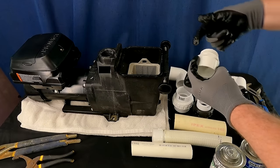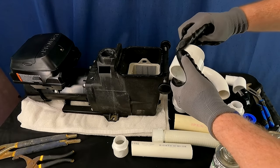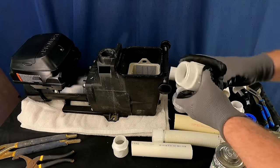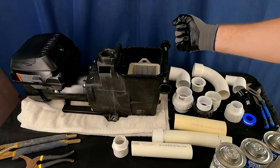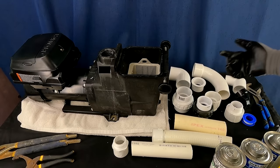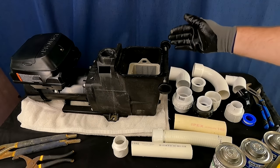You could strip the tape off, clean it, start again with fresh Teflon tape, then take some 100% silicone — not silicone caulk — and smear it around the threads. Same deal: hand tight, but when you go to tighten further with the wrench, maybe even less than a full turn because the added silicone makes the fitting more slippery and you'll get it in further than without. Be careful not to over-tighten when using silicone since it's now easier to go too far.